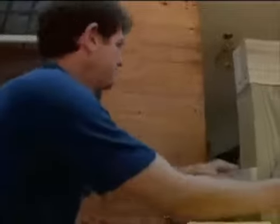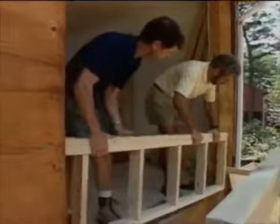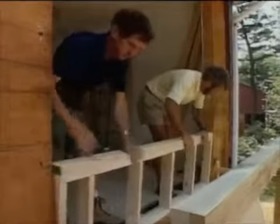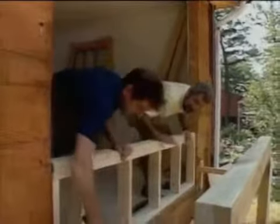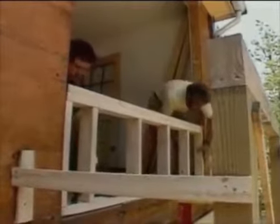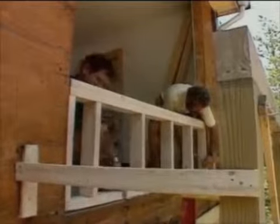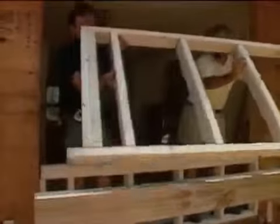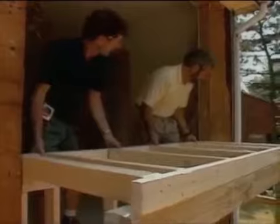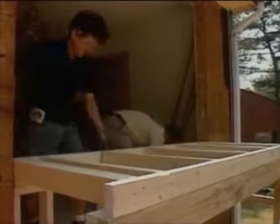What's the next step, Riley? Well, the next thing for us to do is frame this little stud wall right in here where the patio door used to be. So this section of wall is exactly the same height as the structure outside here. And we'll just spike it into place with 16-penny nails. Goes right with the existing frame. Now this other section acts as a tabletop to receive the box bay. That's right. And we'll just nail it in place — nice, sturdy area.